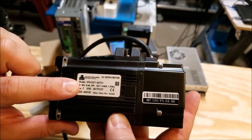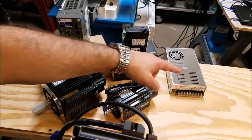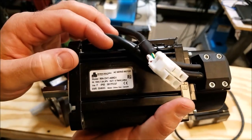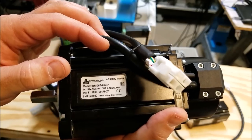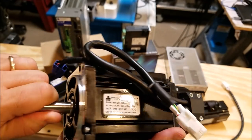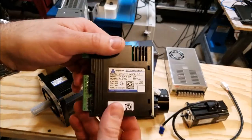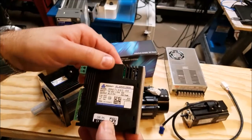The plan is to use two of these NEMA 23 motors, two of these drives, and one power supply to do X and Y. For Z, I have the NEMA 34 motor — this is an 86NDHT A6MD1 NEMA 34, 2.4Nm motor, and this motor is going to be the Z axis. The DYN2 drive is still big enough to turn this motor, so this motor is going to have its own dedicated 48-volt power supply.